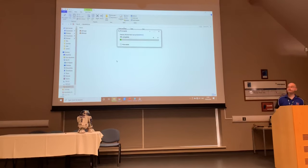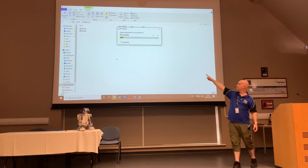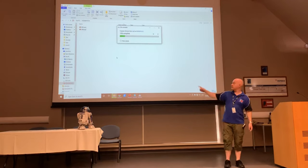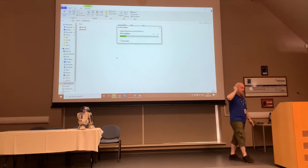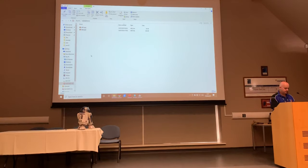Now, notice what's appeared very first, 07 and 08. So when my MP3 player picks these up, it's going to count 07 as my first file. So if I say play track number one, it's going to play track number seven. All right? Absolute bombs. A complete pain. That was probably a bad choice of files to copy.